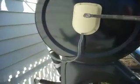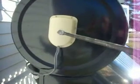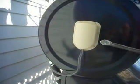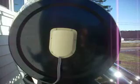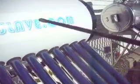Right here we have an electric backup heater that's tied to a controller. It plugs into an outlet. I have mine run into a 15 amp circuit breaker. In that controller, you can tell it when to turn on and when not to, and it will determine for itself whether it needs to turn on. At any rate, the cold water comes in the top, comes down through the body and goes through the coil and comes out here very hot, where it returns back into the kitchen sink.